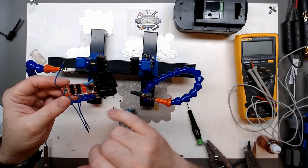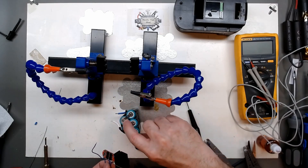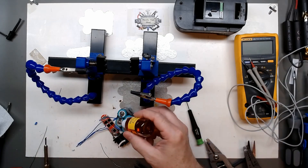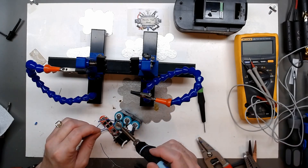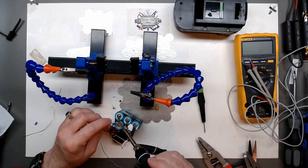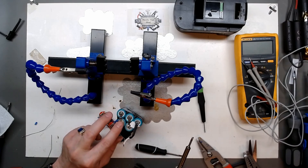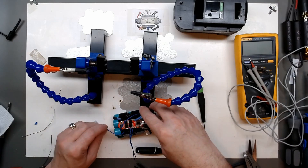Cell five will be your final plus. I didn't make these wires super long, and rather than coming all the way down I can hit right here on the minus of this cell since they're connected together. I'll put a little bit of rosin flux on here and solder onto the tab. I just scratched up that little tab sticking up off the cell, cleaned it up, and there we go - connected very well. No heat transferred to the cell - I can touch it immediately with my finger.